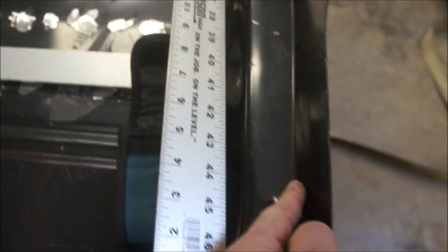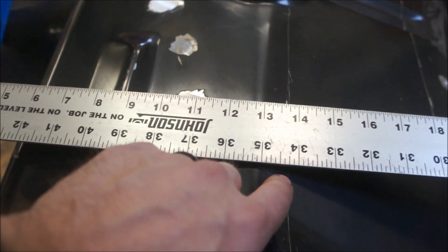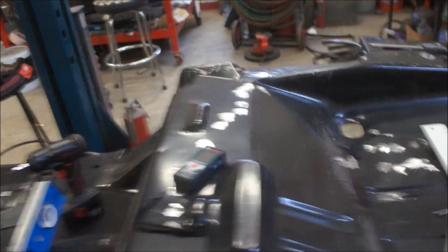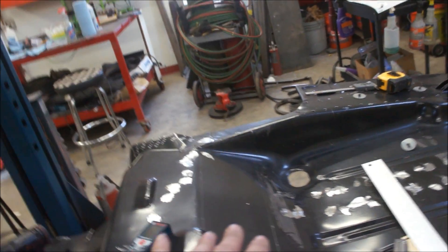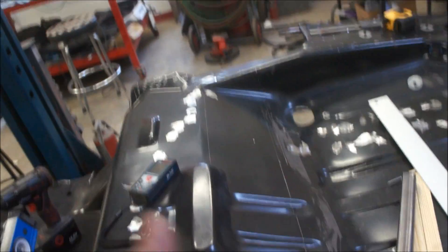So if any of you guys are confused about that, this is what you do. Take a straight edge, sit it right into that little deal right there, and run it right up to 34 and a quarter, then scribe the little line. Same thing on that side, running straight up, scribe the little line. Now here's where it gets a little tricky — the box is six inches wide, so I have to come back six inches. But this is at an angle, so if you go six inches down, that's not six inches wide, if you understand the way the geometry works.